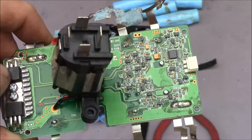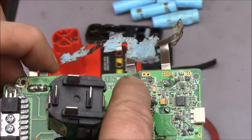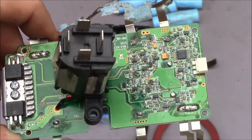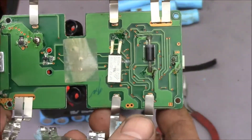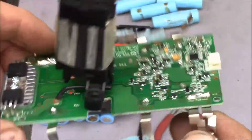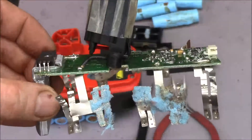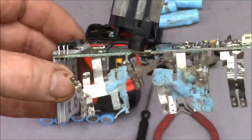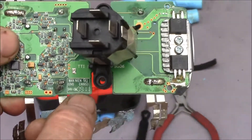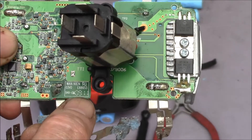They also put the MOSFETs up on top. The BMS board is just big enough to pick up all the terminals — not quite full size, but pretty close. There are a few components on the bottom, and I'll try to find any data sheets on those. This is what's in one of these extended capacity packs. It's got the oldest, or probably the second oldest, design, and this one has an '09/11' date code — probably 2009.